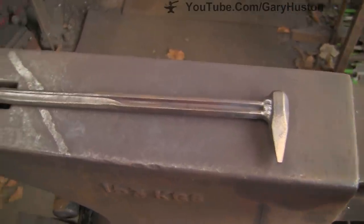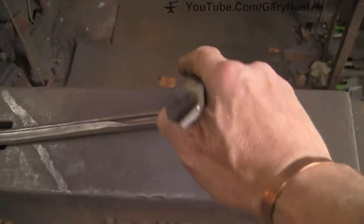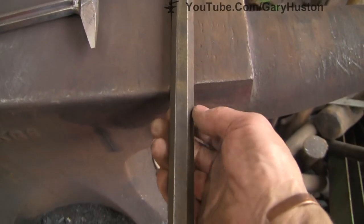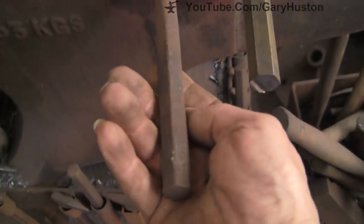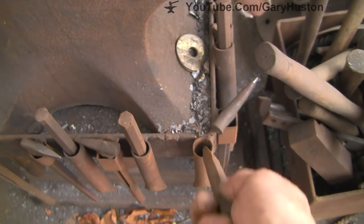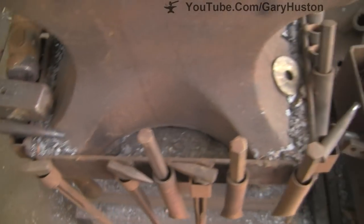This is where we got to in the last video — we've made the stamp. Now we've got to make the pritchell. I've got another bit of this breaker steel; it was free so I'm going to use it. I cut the end off because it was a chisel point. It's a very fine grain, so it's a good bit of steel. This is three-quarter. All my others down here are out of five-eight — about an eighth of an inch bigger. I only made those out of five-eight because I came across a box load of five-eight Allen wrenches, straightened them all out and used them for pritchells. I've got them all different sizes — ranging from quite tiny up to relatively big, and now even bigger.